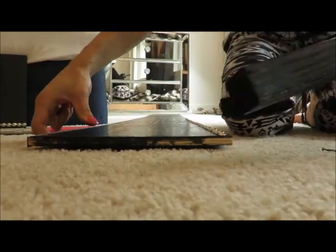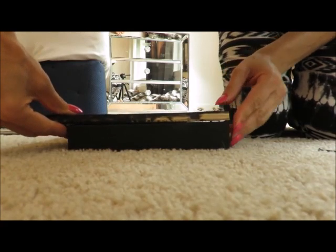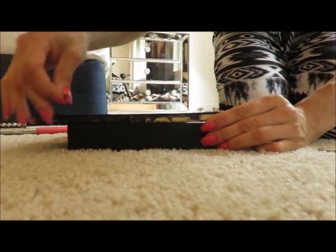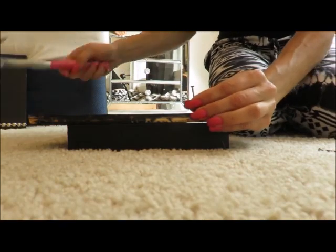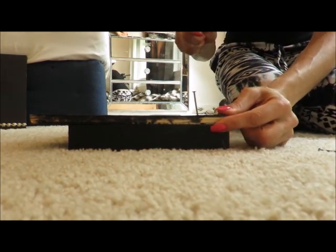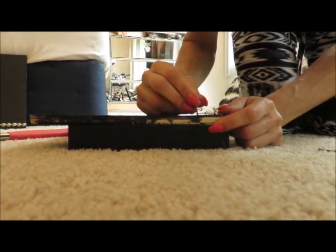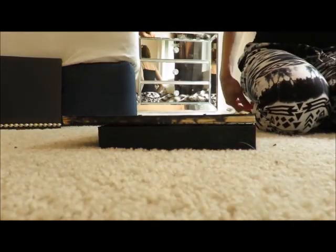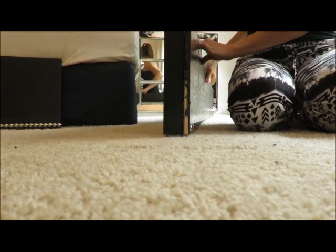Using this stabilizer piece of wood, I'm going to use two nails to hold the pieces into place. Plywood is very thin, so if we were to nail them together without this, it's very possible that the wood could split — and then we would be DIY done, waste of money, waste of time. So I'm just going to put two nails in, one in the bottom and one in the top.